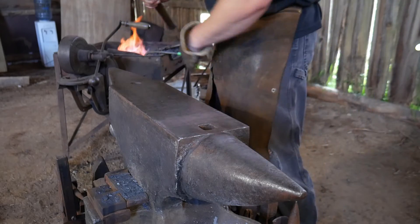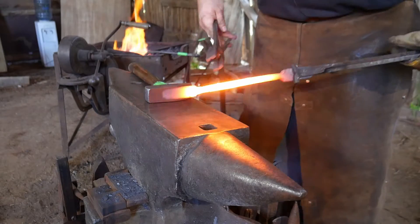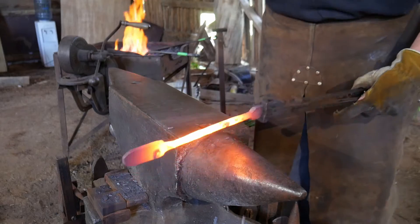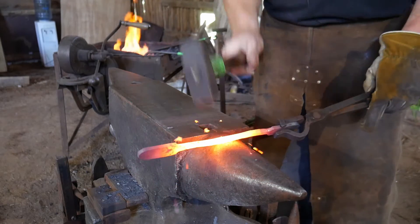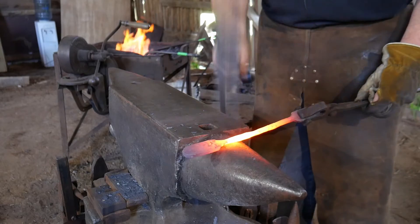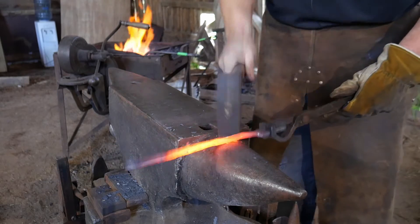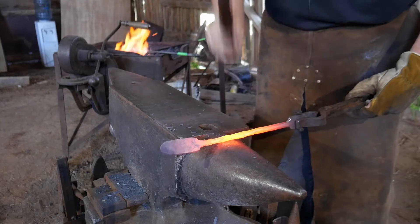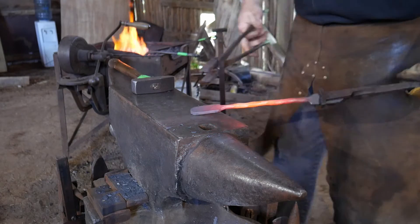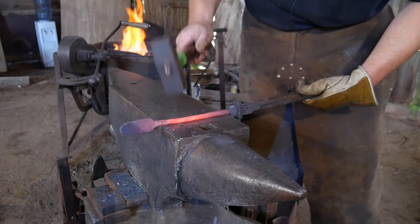Good ironwork is always well thought out - it's never a mistake. First things first: be intentional. I'm going to make sure that's straight, and now we're going to use an intentional texturing. I'm working back, doing about a quarter to one-eighth turn each time on the horn to provide lumps in a proper repeatable pattern. It looks a little random, but it is not. It gives a very specific stem look to the piece.